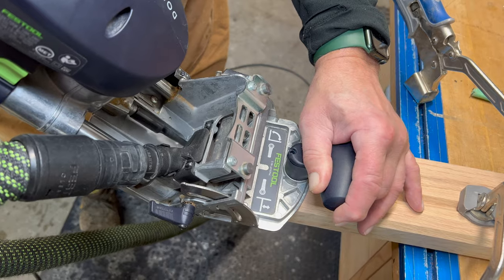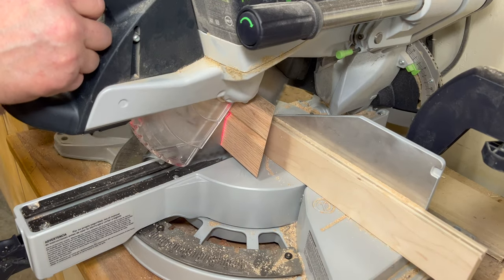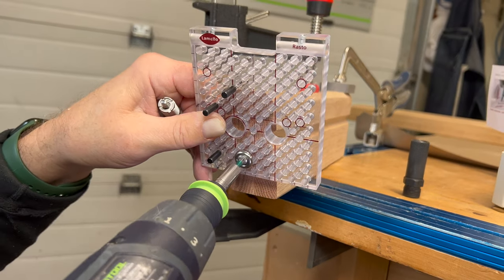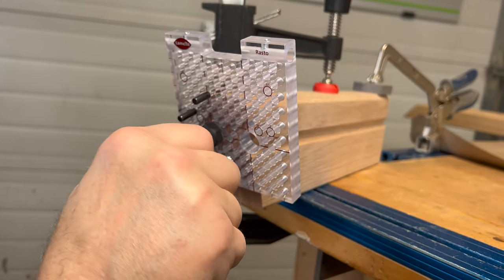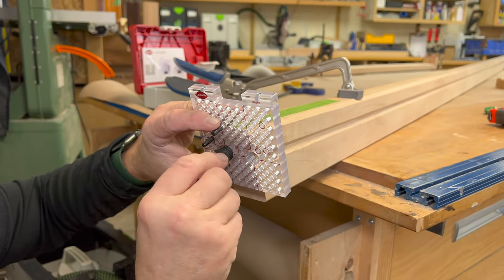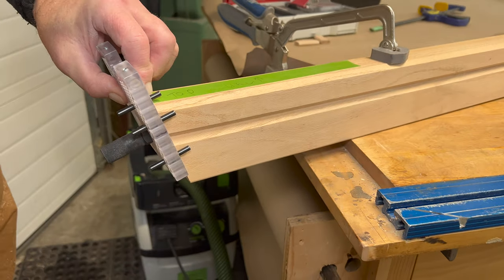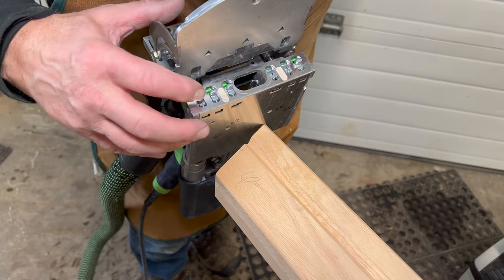Now that we have the four-foot piece of railing done with the miters, we're going to tackle the longer piece of railing with the Lamello Invis joint in it — it's going to be pretty much 14 feet long altogether with three miters in it. If you've never seen a Lamello Invis in action, you're going to be amazed — it's basically magnetic joinery. I have two videos featuring this tool if you want further details. The Lamello Invis is about $750 for the kit, and for connecting two long pieces of railing it's very difficult to clamp and hold them while the glue sets, so for me this tool is a good addition.